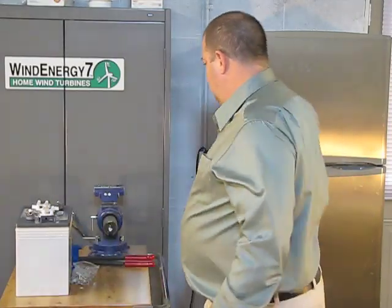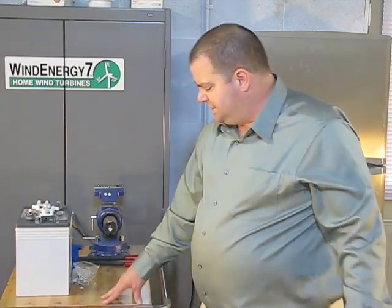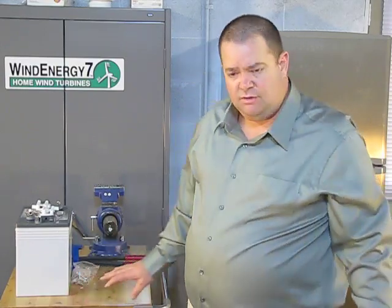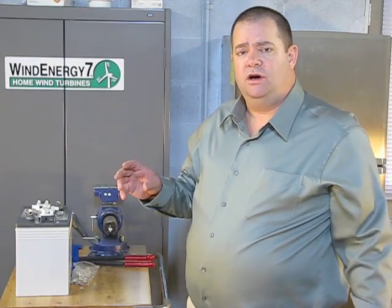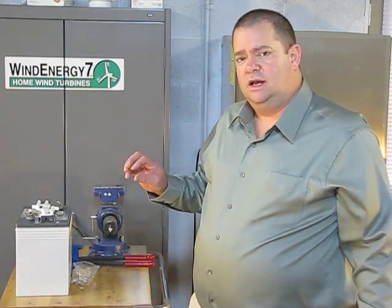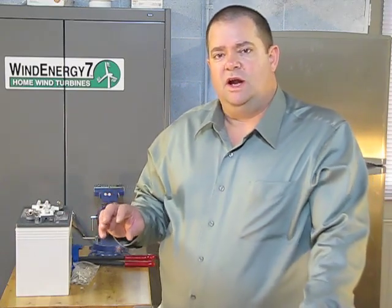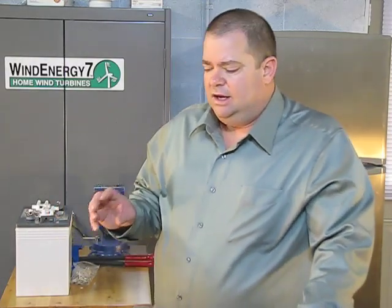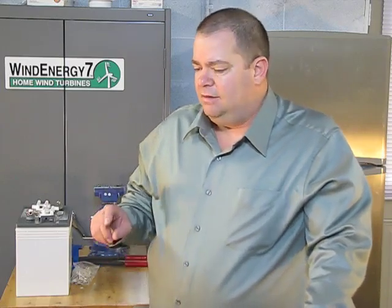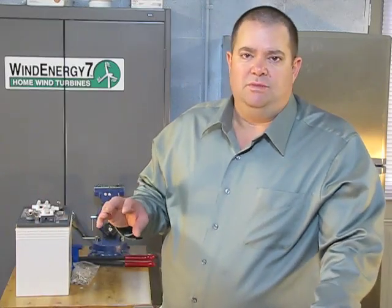Another thing about supplies or tools for battery banks: I don't have any handy to show you, but there's a spray you can buy at your auto parts store, specifically for terminal ends on battery cables and connections. You want to spray all your terminals and cable ends with it. It's typically a reddish spray that comes in a really small aerosol can, like a perfume can, a little bitty can. Basically, you want to coat all your connections of the battery terminal and battery cable, all the ends, with that red stuff, because you don't want any corrosion building up on your battery bank.